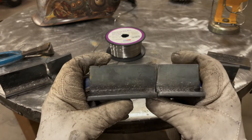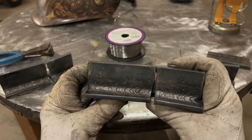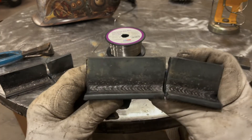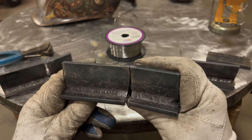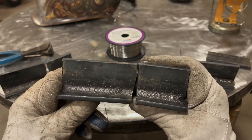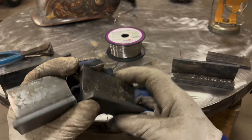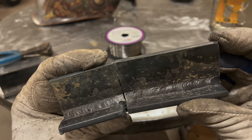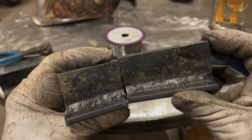The scientist in me said, well, why don't I try some stuff? So with the same wire and same settings, I ran a circle-E pattern rather than just going straight in and dragging it. This weld has no evidence at all of porosity. Then I ran another pass on the back going straight in, and I got porosity all over it again.